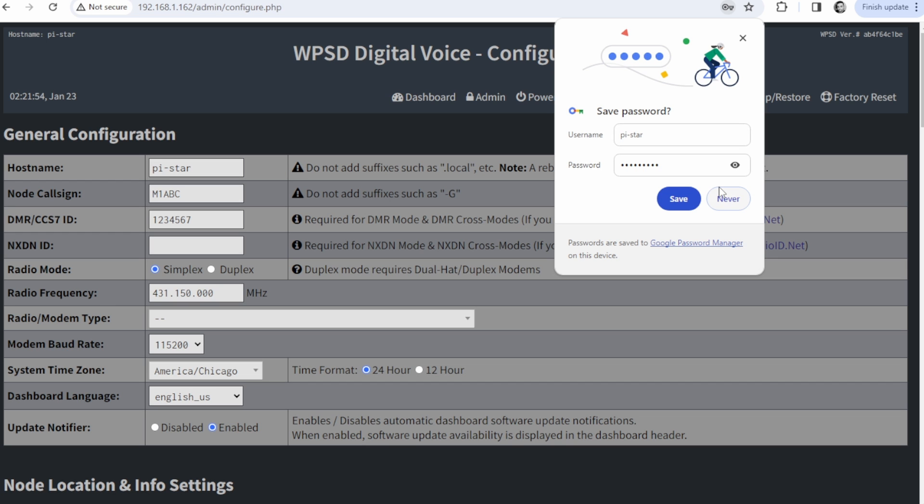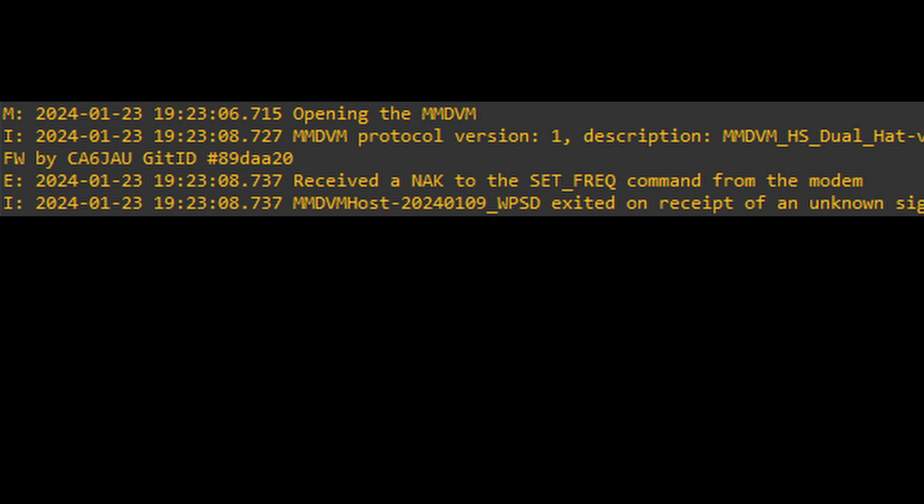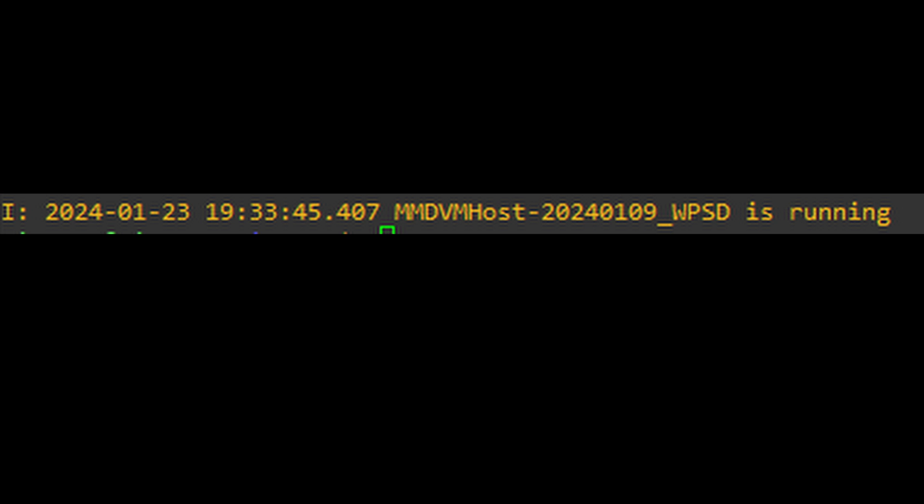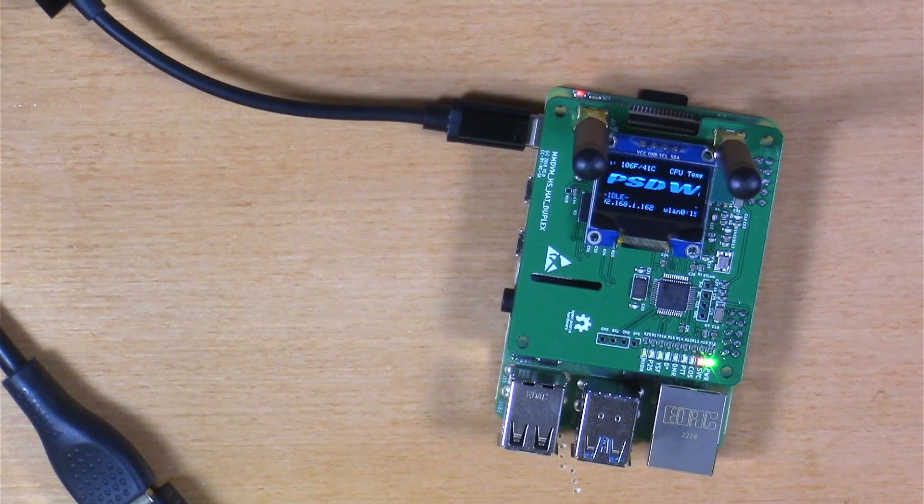I'm not going to dig into all the details of my config — you can check out Steve's video that I'll link in the description, and that'll walk you through everything you need. So I went over my config, thought I had everything right, but I could never get it to fully come up all the way, and the screen on the hotspot never showed that basic status screen. I finally found this when I looked in the logs — and just a reminder, if something's not right, always go look in the logs. At some point I had upgraded the firmware, and as part of that firmware update there's a certain bit of code that won't let you set your frequencies to those conflicting with a satellite — the gentleman's agreement satellite frequencies. As soon as I corrected that, you can see here where it fired up the rest of the way, and I saw the expected status on the screen of the hotspot.